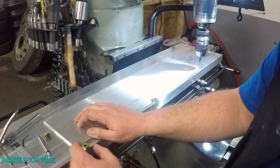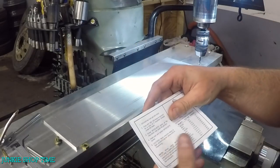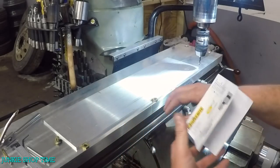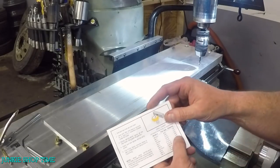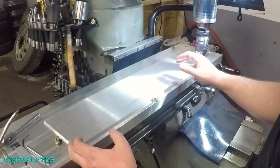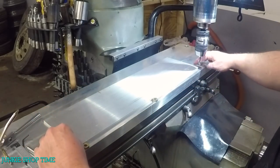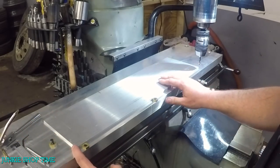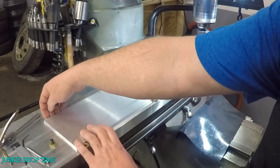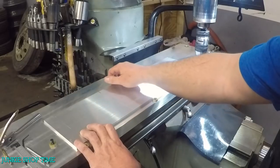What I did is I came in and touched with my center indicator to find zero here. On the instructions - I've never used these before - it says quarter-twenty and gives the distance from the workpiece. I want to be 300 thousandths, but it's supposed to be 308. We'll use 308 up here when we do the top and sides. Today I'm doing the top and one side. What we have to do first is get all these in there, touch off, move over 308 thousandths, drill and tap three holes right here, and get this clamped in so it doesn't move side to side.